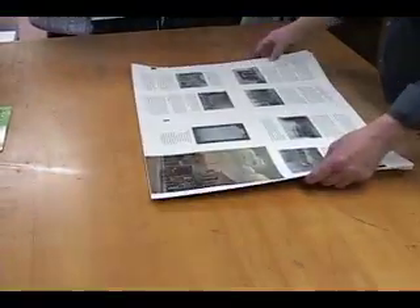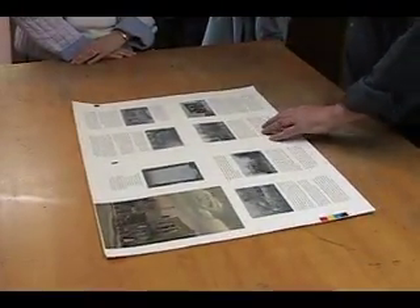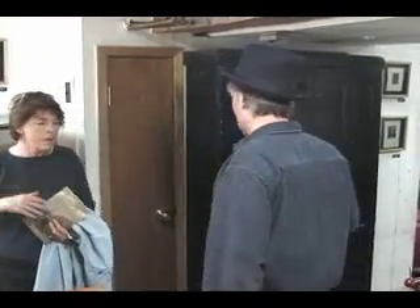So then, this is fairly typical of what we do. We print eight pages on one side of the sheet, and eight pages on the other side. And then we take the printed sheets down to the other end of the room, and put them on a machine called a Baum folder, because it was invented by Mr. Baum. And the folder takes the sheets and knocks it down so you get sixteen pages in order, which is called one signature. So we'll show you the folding machine.